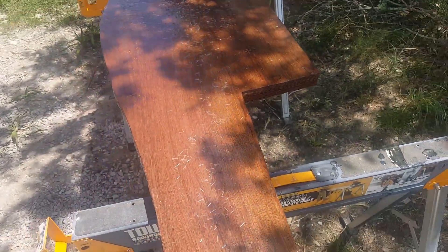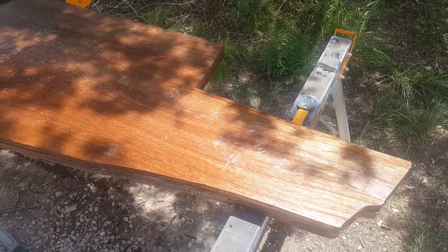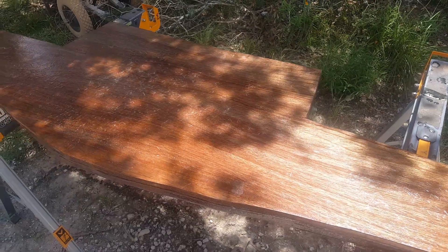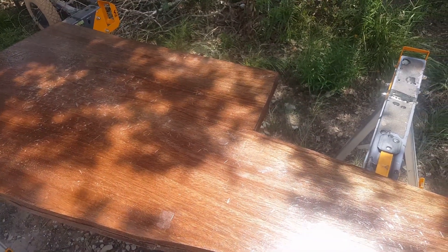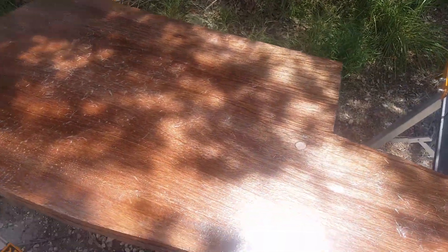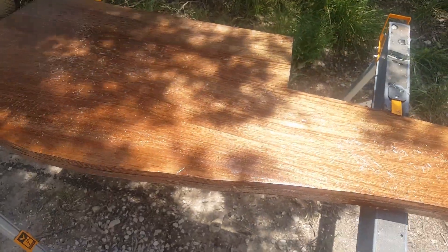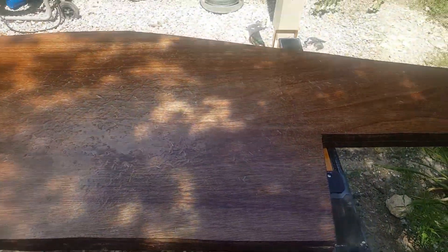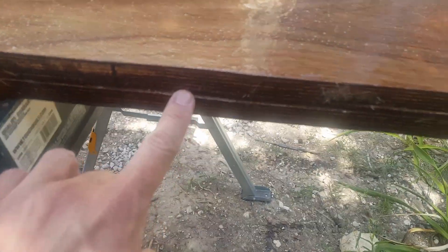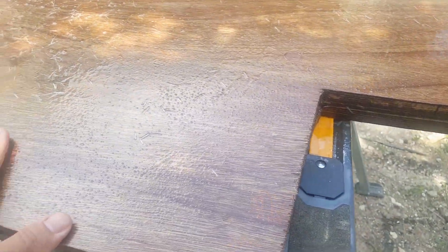It's the second day after the three layers have been epoxied together. I took off the clamps around the time it started kicking off — you could tell because the bond on the clamps was getting questionable in terms of whether I'd be able to remove them if left on any longer. It left a little divot where the clamps were, but no big deal. We're going to sand this down. You can see the nice reflection — it came out really nice with a glossy finish, which I'll sand down as we apply the Kevlar.